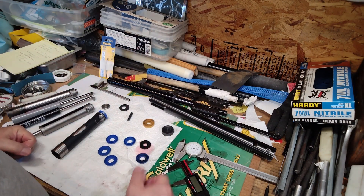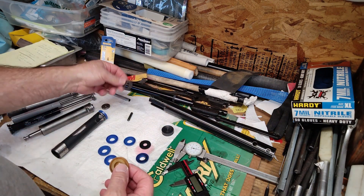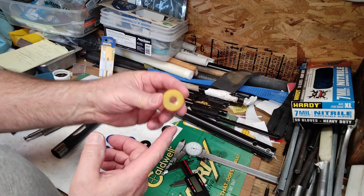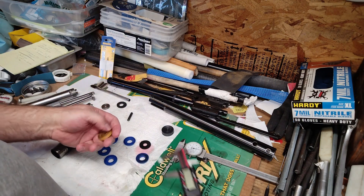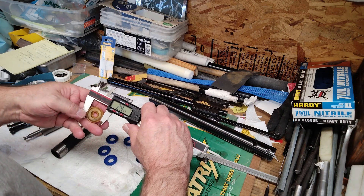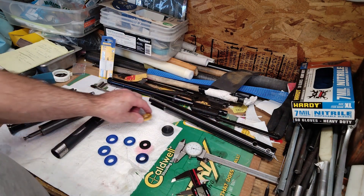Here is the original piston seal — it's very thick and had a rubber shock washer behind it, similar to this one which is now torn in half. It had a small button on the piston that this slipped up over. It is very hard — disgusting. When we measure it, it comes in at 29.6 millimeters.